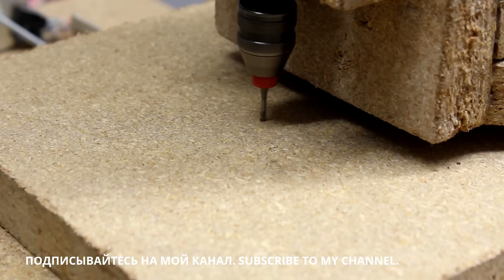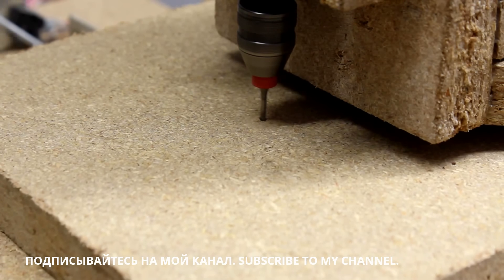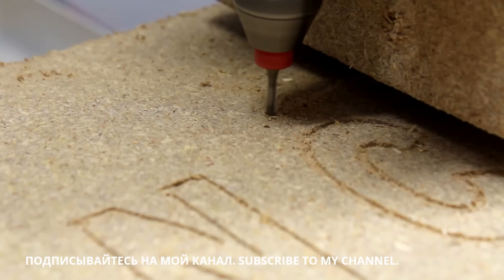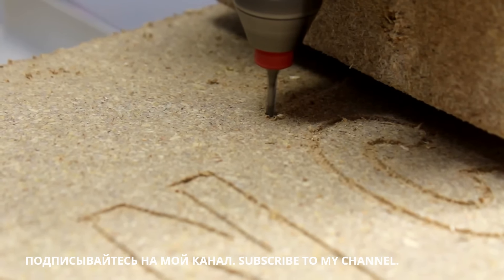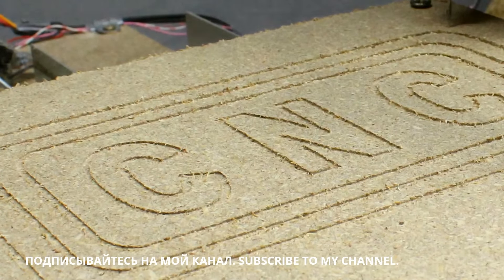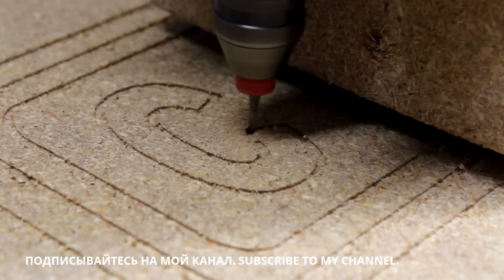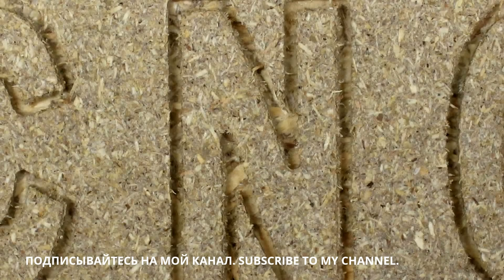You can also engrave wood. Here I am engraving 20mm chipboard as used for the frame of the machine. The mechanism of the CNC isn't ideally plain and the drive doesn't move ideally in parallel to the base plate. As a result, the router is diving into the material with varying depth when moving along a path. You must have a close look at the plate to notice that error. You can lower the router for a second run — leave all other parameters of the software unchanged.